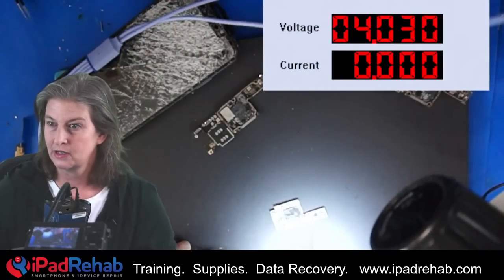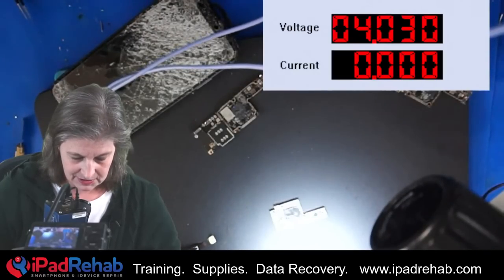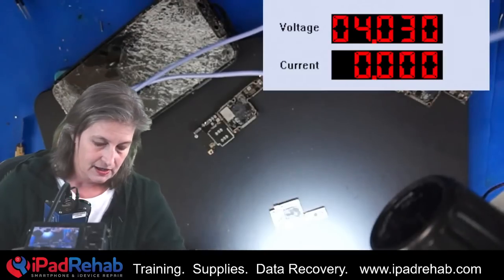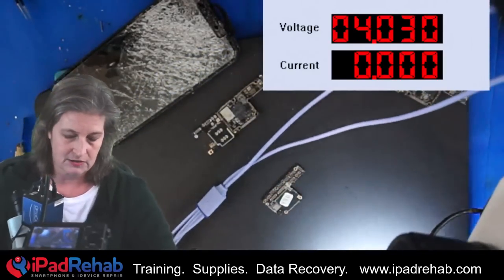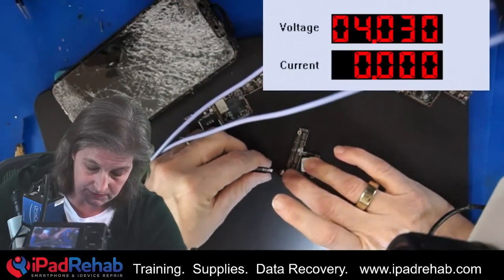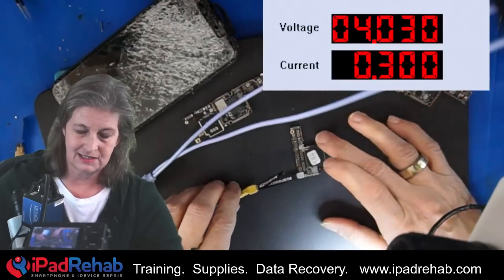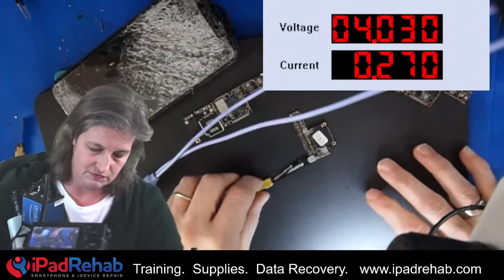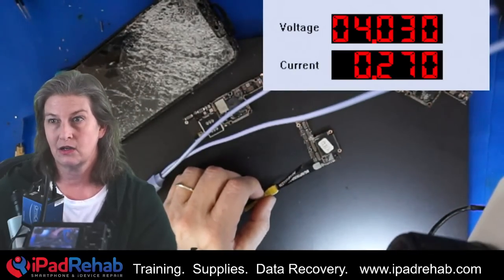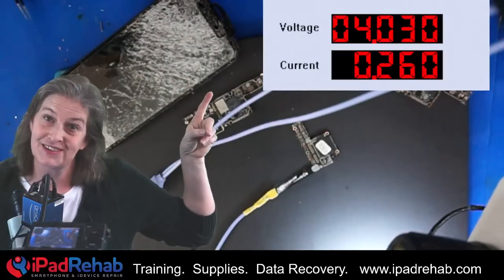Let's see how you guys are all doing. 'Love this content,' says Gail — well, that is awesome. There's a lot of multitasking that goes on with live stream. Louis used to live stream same as me, and then he stopped doing that and made a separate channel just for the live streams, and then he turns all of those repairs into videos later. All right, so we do see a current leak — 0.270. We've got a current leak, but it's not the main power rail, it's not battery VCC.